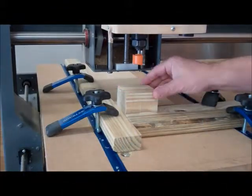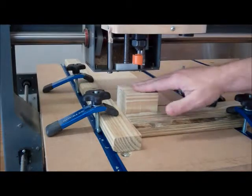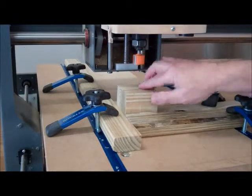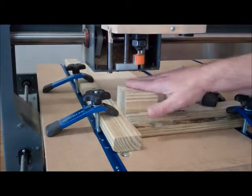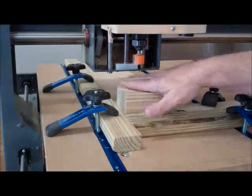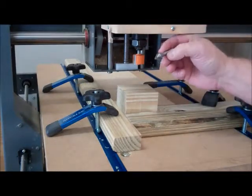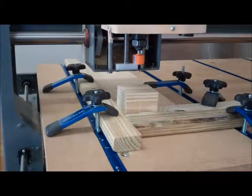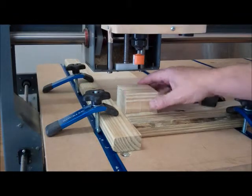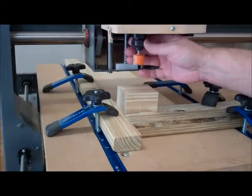I start out by getting my little cube block locked in here securely, and I'm going to cut the round hole with this one inch round bit and just plunge that in slowly — I'm actually going to make about an inch and a half hole. I put the diagonal lines across the cube and use this bit with the point so I can get a good accurate center. Now I'm just going to cut down and keep flipping the block over until I cut that hole on each side, and then I should end up with a cube inside there.